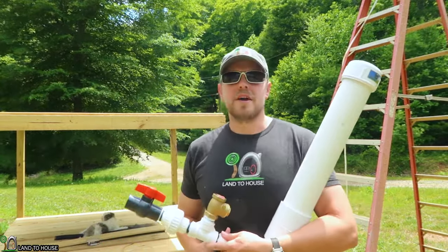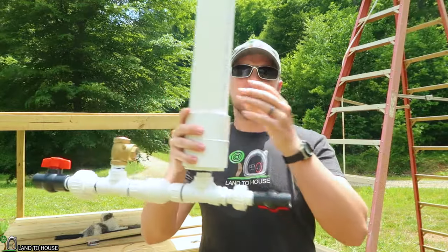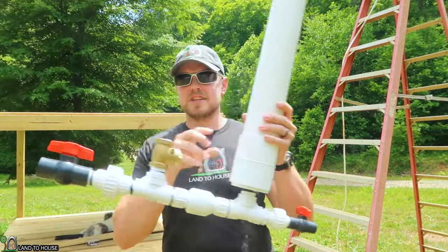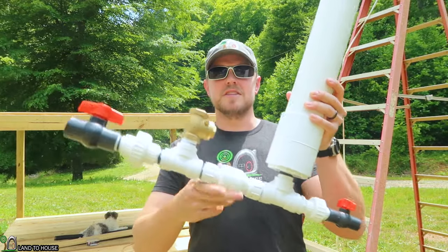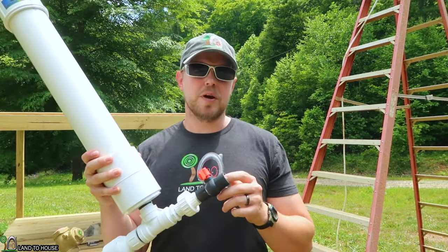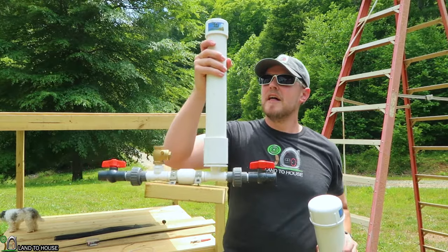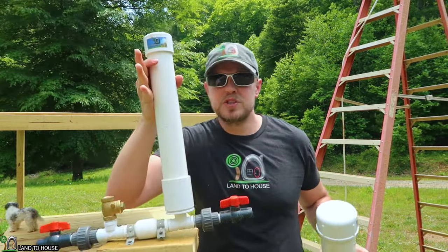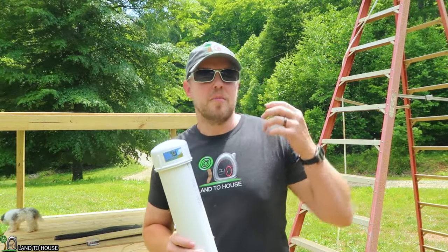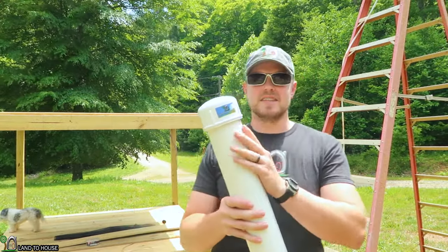This one-inch pump requires around six gallons per minute to operate, which means when you open the drive pipe, the waste valve in combination with the delivery pipe is going to require about six gallons. If you close this off, it's still going to use six gallons — it's just going to all be shot out of the waste valve. So we know it requires six gallons, and that means it's going to pump a higher volume of water uphill than the half-inch pump would in the same setup, because the half-inch pump needs around two to two and a half gallons a minute to operate. So the lift is not changed, but the amount of water required to run the pump and the amount of water you get at the top is increased as the pump size goes up.